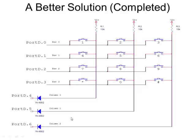The solution is to put diodes on the column outputs. When you write a one — which is a direct short to VCC — it reverse-biases the diode, so the column node is floating rather than hard-connected to VCC. You'll still read a safe one through the 10K pull-up resistor, not a dead short to VCC. The diodes just make the design a little cleaner and a lot safer.